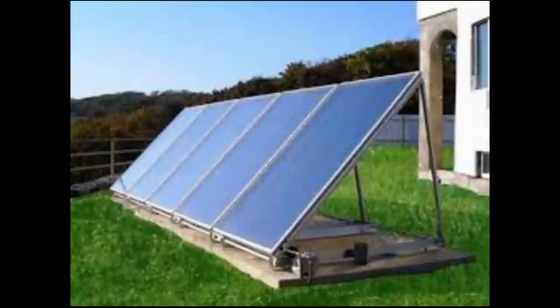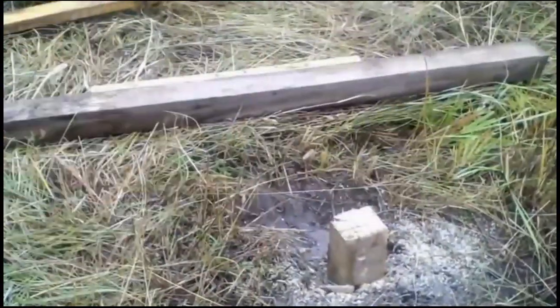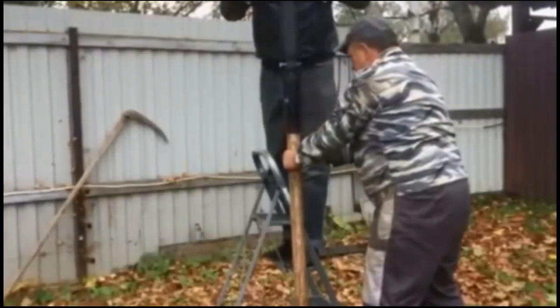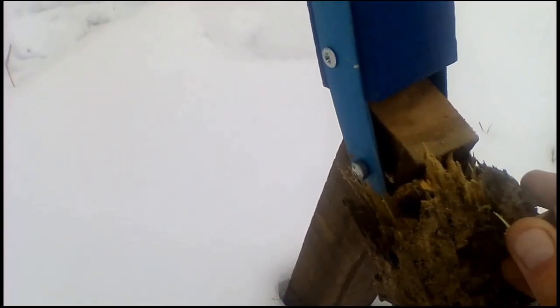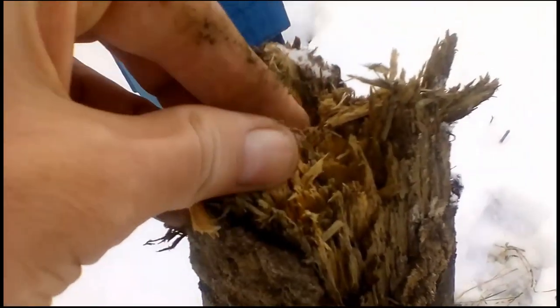Now I am showing a variety of variants for fixing solar heaters on the ground, but I used the cheapest variant when my solar heaters are fixed on such stakes from pine which grows in central Ukraine. We hammered the stakes to a depth of 30 to 60 centimeters, and the soil was loam without stones. Now I will break this old stake which was hammered into the ground four years ago, and we know that the weak point of a wooden stake is the boundary between soil and air where its wood is rotting intensively because of fungus. We see that the stake has become rotten; however, this stake was made from poorly dried wood without antiseptic, but it was coated with old engine oil. However now I make stakes from dried wood, and I soak them with cheap iron sulfate which is an antiseptic. Therefore I hope that their lifespan will be several times more than four years.